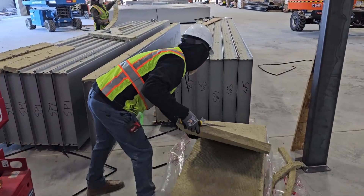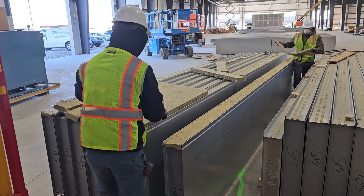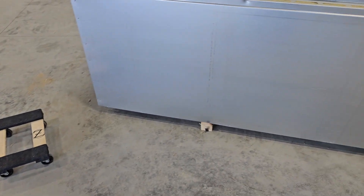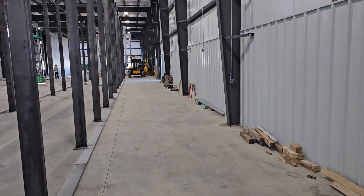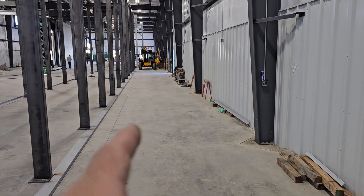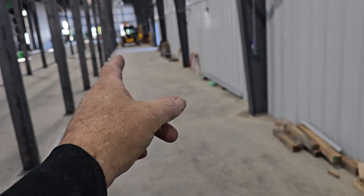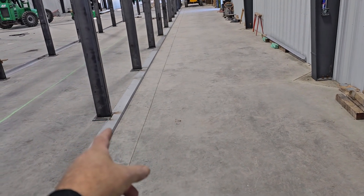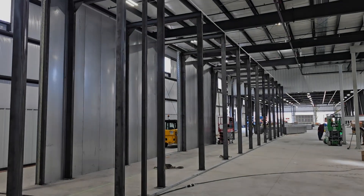These are insulated panels. The tongue side gets one inch of insulation — easier to do it on the ground. After that, they go on two little mini dollies, knife-edge, and get rolled into place. We use the loader — screw an eyelet on one end, hook a strap to it, take it vertical, lift it two inches, then drop it in the channel. That's how the wall panel goes in.